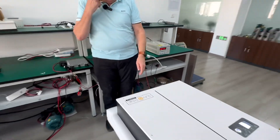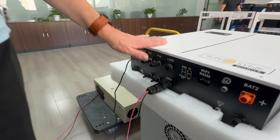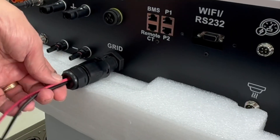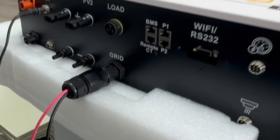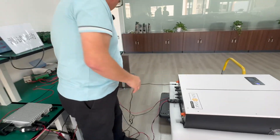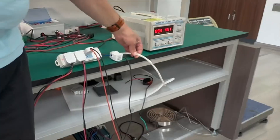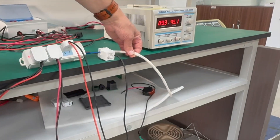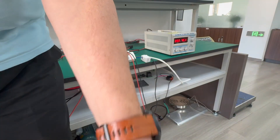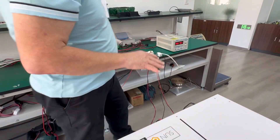If you come around and have a look, we're only connecting to one port. At the moment we've just simply connected to the grid and haven't used any other connection — so it's purely the grid. All this is being used as a battery. In addition, we've got the CT coil. This power here would be considered the incomer, so imagine this as the incomer for the main fuse board. The CT coil connects here as the current limiter, so we're now running.